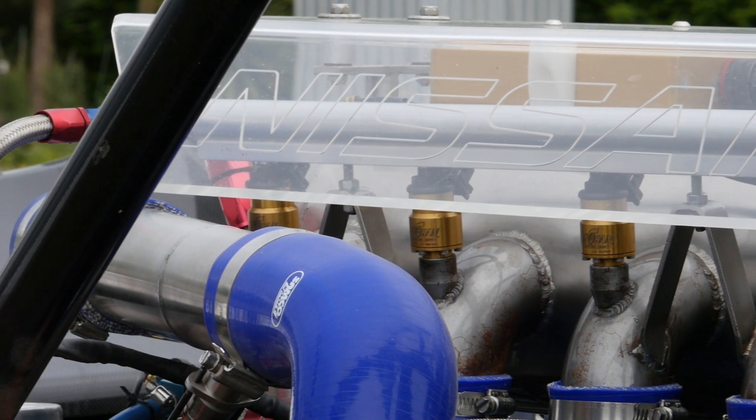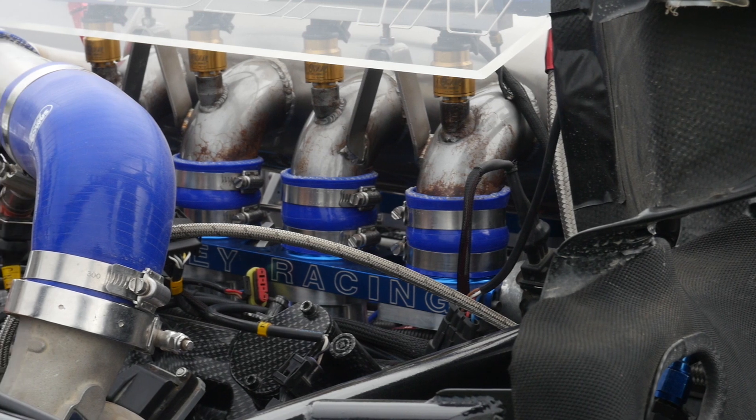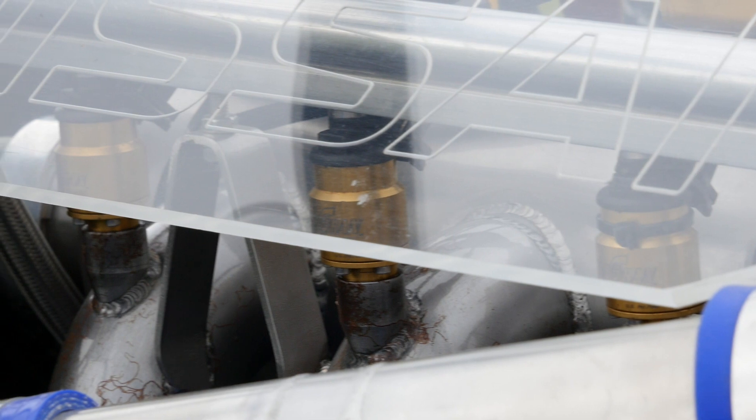The rest of the fuel injection is handled by a set of Moran 235 pound per hour injectors. The factory intake plenum from the VK56 is long gone and the engine is now running a set of eight individual throttle bodies, with the Moran injectors fitted above the throttle plates. At idle and cruise this can present some challenges, as getting atomised fuel past the mostly closed throttle plates is difficult. Of course this is only an issue when the boat is started on the trailer and idling up to the start line — most of the run through the course is at full throttle. Mounting the injectors further away from the intake valves allows the fuel a better chance of vaporising, which allows the engine to make more power.